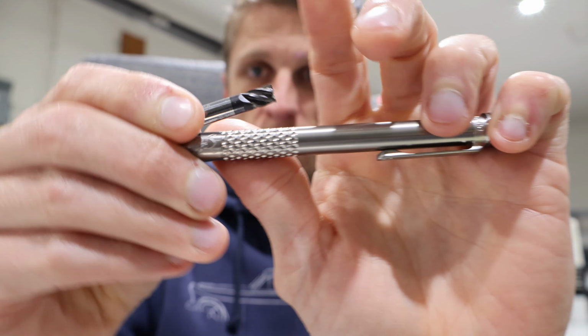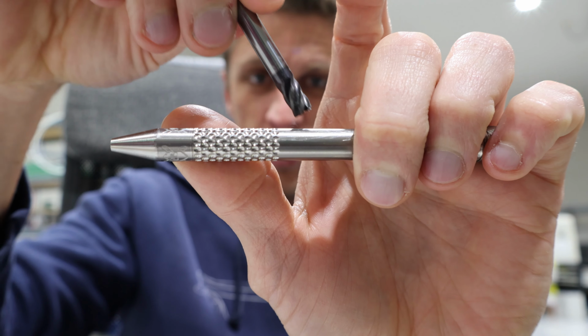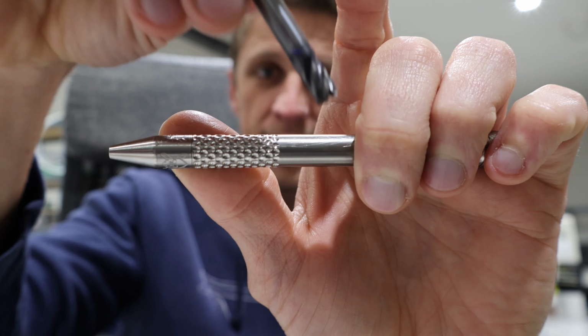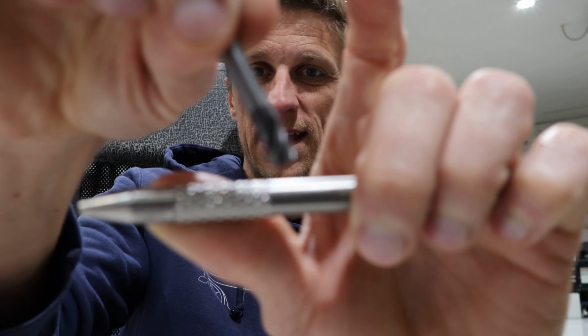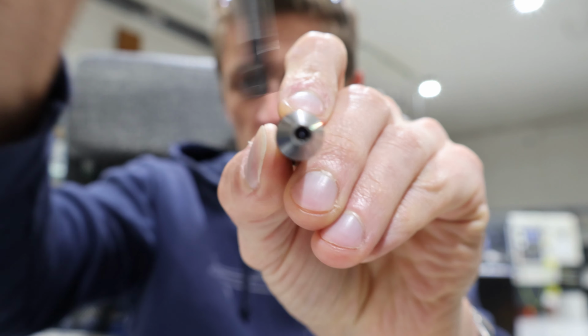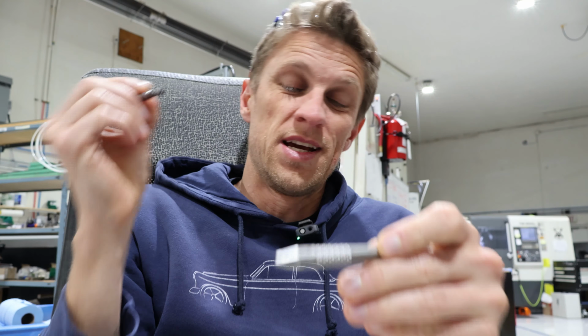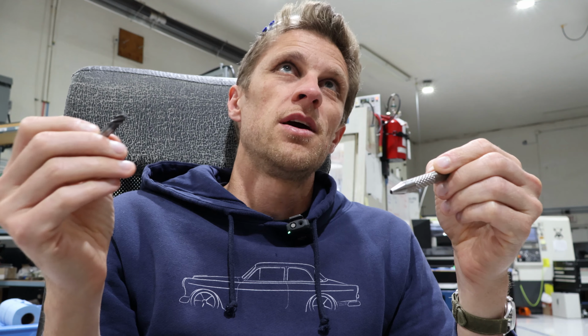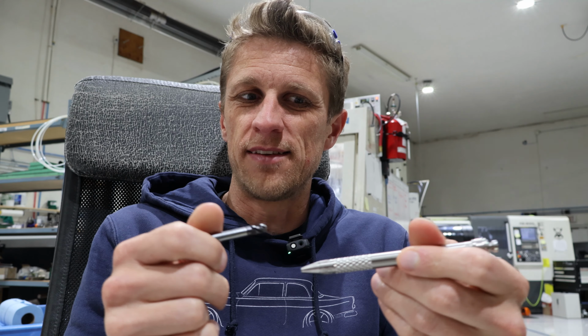If I want to take this flat end mill and rotate it at say 45 degrees and then make a cut this way, like a plunge or a slice, it's going to make a sliver. And I can do that bop, bop, bop, bop, bop. I can even come off to the side of the part in this way, and I can go like this. I can make some really cool features. And this is where the artistry and the creativity and the tool paths and the way the tools work and the angles that whatever machine is available to you, you start to combine all this together and you create some real magic. And I haven't gotten that far, but I know in my head it's possible.